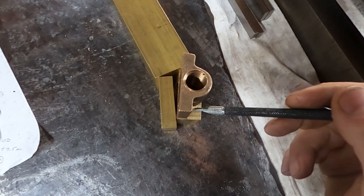Now nothing about the original piece is symmetrical, so I had to come up with weird ways to measure it so that I could figure out the hole spacing in relation to each other. I used some 5/16 inch hardened drill rod in order to figure out the spacing for these mounting holes, and then from there I used squares and various other things to determine the center hole relationship.